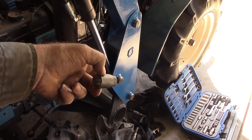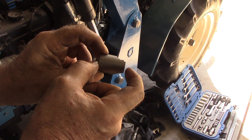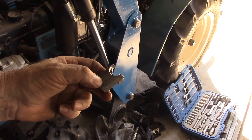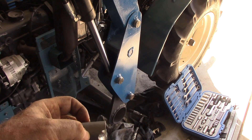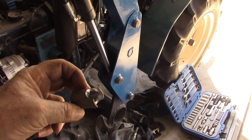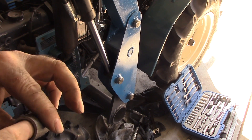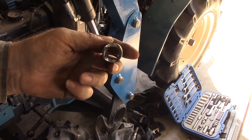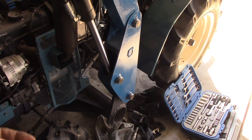Here's the black metal fitting for the hydraulics. It was just a straight sleeve that length, and I put it in the vice in the drill press and I've run an annular cutter down there — the size of the outside diameter of the return pipe for the hydraulics. Because I haven't really got room to put a T-piece in, I'm going to weld this onto the pipe on the outside, and then run an annular cutter down the center of it to cut into the pipe and make the opening that way. Then I'll connect the return fitting from the front end loader control to this.